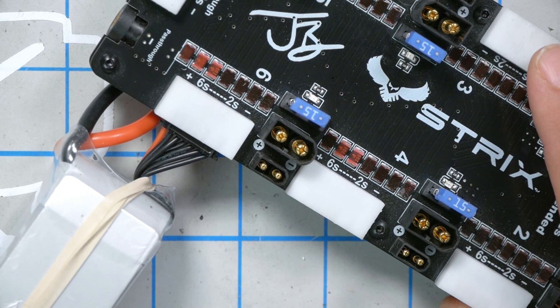You see those polyfuses turn red? There wasn't even a spark. That's exactly what should happen. If those polyfuses hadn't been there, we would have at the very least probably damaged the traces on the board and maybe damaged the battery or worse. But the polyfuses protect you. Don't rely on those polyfuses on a day-to-day basis, because they do wear out over time. Eventually you'll find that your charger will stop balancing the cells properly when you use it with this board, and then it's time to retire it. That should take a few years, but the more you trip those polyfuses, the more likely it is to happen.